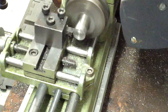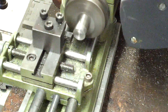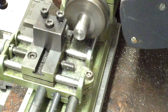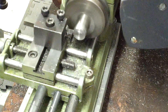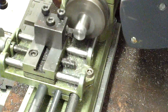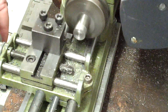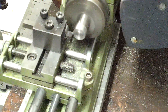Taking a real shallow cut here, just to clear off anything on the outside before I dig in. We're running 850 RPMs by the chart, and that 8-degree tool doesn't seem to be having much trouble with it. You hear a slight dip in the RPMs. 416 is not the harshest thing you could ever machine, but for a Unimat I'm sure it is burning its breakfast this morning.